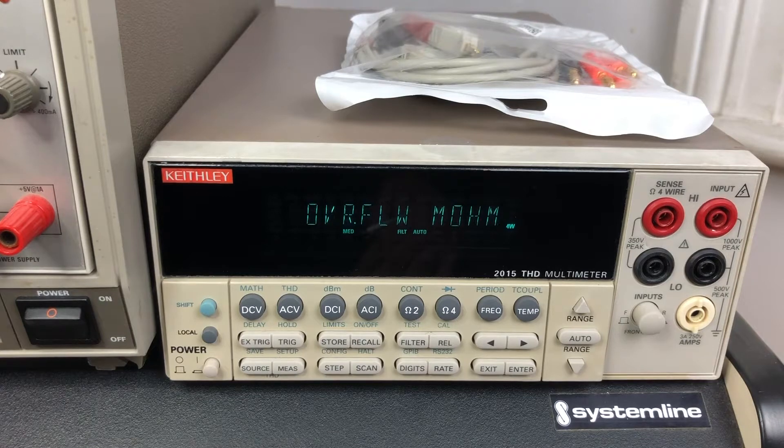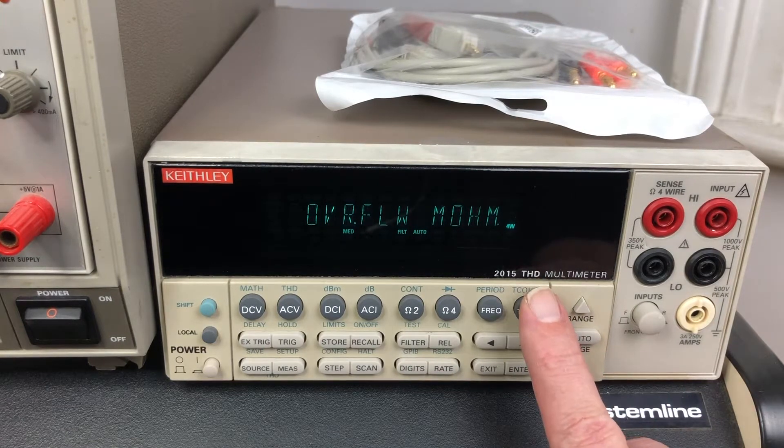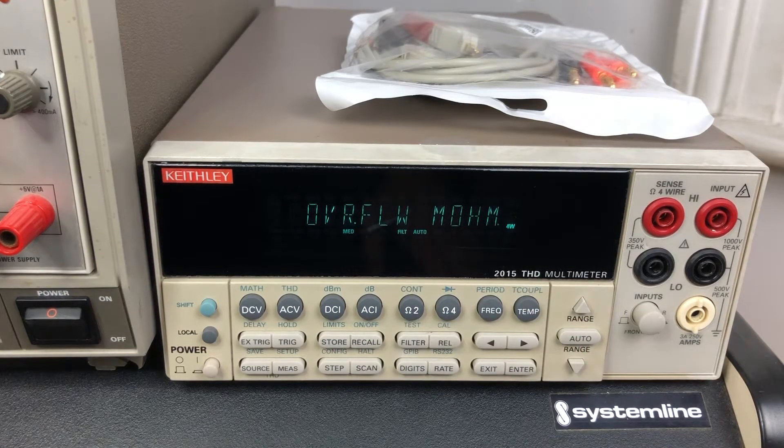I got it because quite unusual for a bench multimeter is its ability to do THD. It has a very accurate sine wave generator in it and obviously THD measuring circuitry, so you can measure the THD on all sorts of things. But it's also a really beautiful bench meter to use — very fast acquisition, much faster than my old handheld meter. The functionality of this thing is really quite amazing and quite flexible.